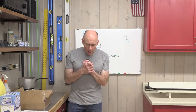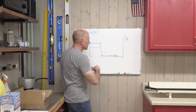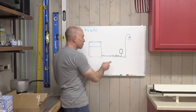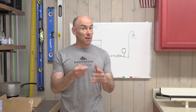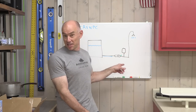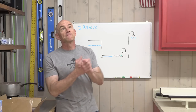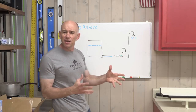So what can you do about that? One approach is to add what's called an accumulator tank — a tank that holds pressurized water. For example, if you get up in the middle of the night to flush the toilet, there may be enough pressurized water in that tank to flush without waking your spouse because the pump never turns on. The advantage is there are no moving parts, but the disadvantage is they can be kind of big and you have to find room to install them.